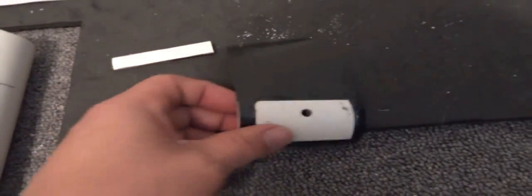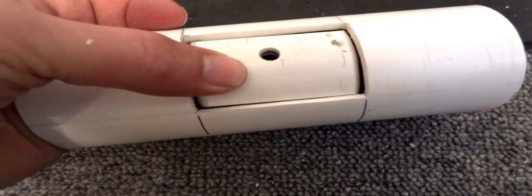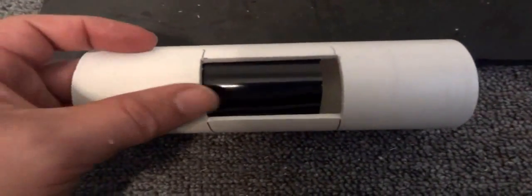That's the hole — it's in the center lengthwise but not centered the other way. Now I'm going to attach the valve to the inside of the pipe. I think I'll sand off the edge a little bit first because it's getting stuck against the bottom part here. You can also do that later when you find it's hitting the inside of the pipe somewhere — just file away a little bit in a tapered direction. That's why you have the rounded edges on the actual valve.